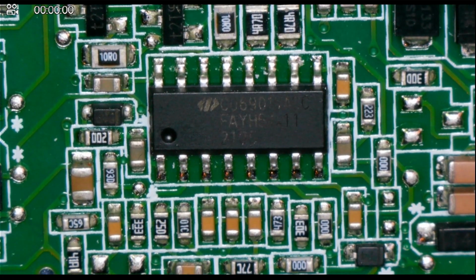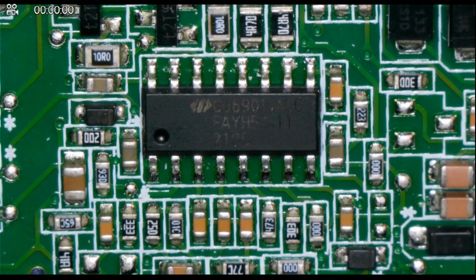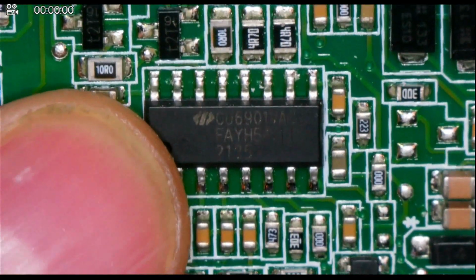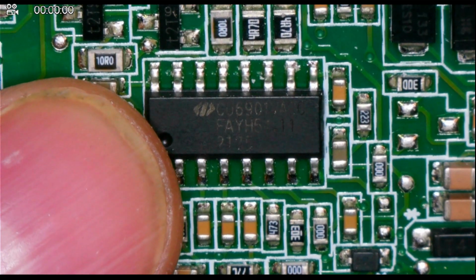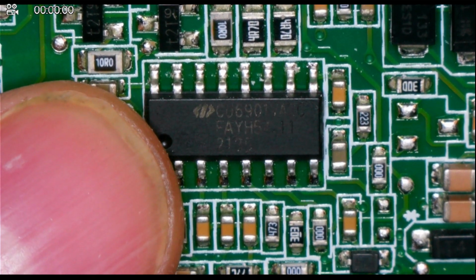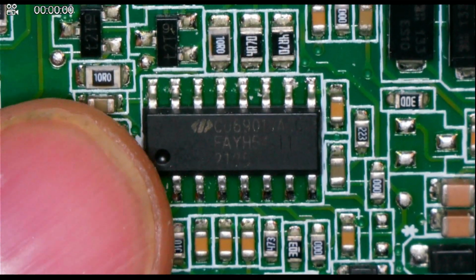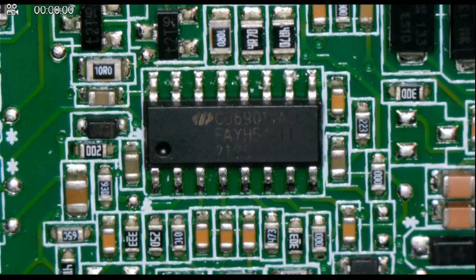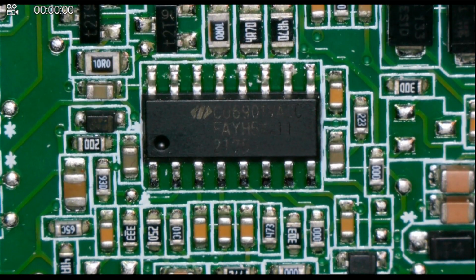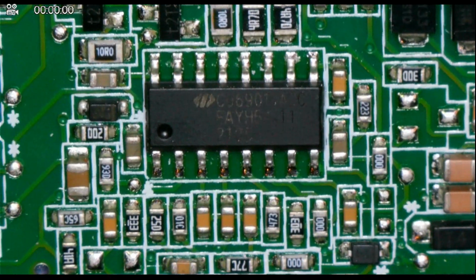What's 15? I think that's the VCC. Can't remember what the other one was now. Give me a wee second, I'll have a look. It was just a winding diode on that pin, and VCC is pin 15. So I've ordered the chip as well. It's coming from AliExpress, so that may take a bit of time to arrive.